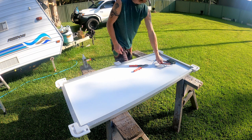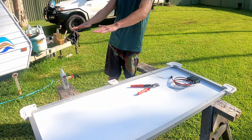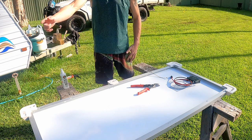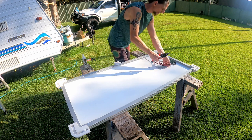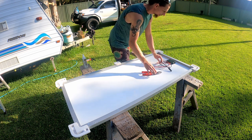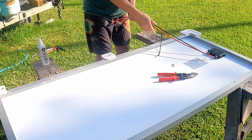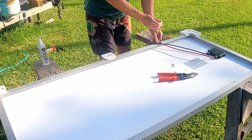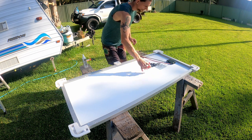One thing to think about is where your cables are going and where they're joining. I'm going to have two panels at the front on the roof — they're going to join between the panels with some MC4 connectors and then travel on from there. So obviously I want to open that up first before putting the panel down. I'm also going to utilize a hole on the side to attach the cable so it pokes out towards the middle and keeps it off the roof and stops it rubbing.